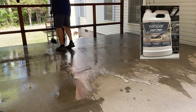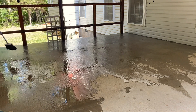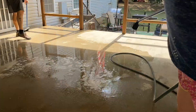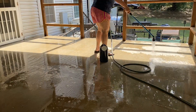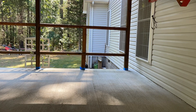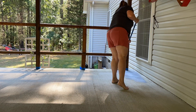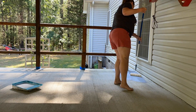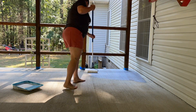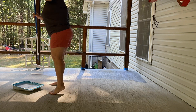We started with a fast prep from Valspar, picked up at Lowe's, put that on and followed the instructions on the bottle. We had also pressure washed the porch before this step to make sure we had a really nice clean base. After a couple of days of drying, I taped off around the post and prepped it really well, then came back in with a roller to roll the prep on the porch. I wanted to make sure this step was done right, because if it wasn't pressure washed correctly or enough prep applied, the paint would peel up.